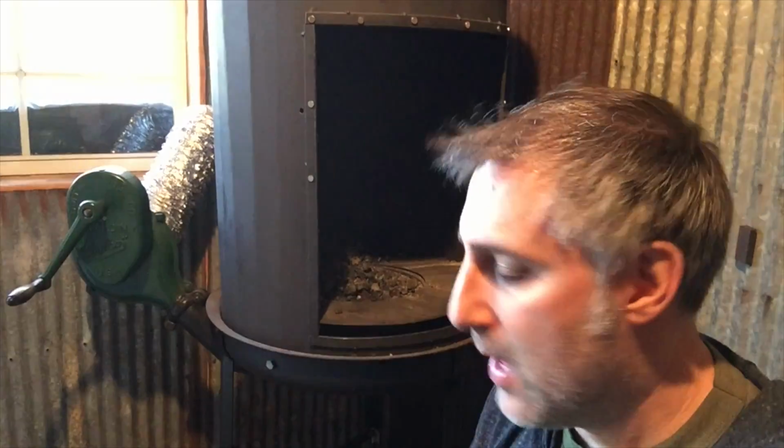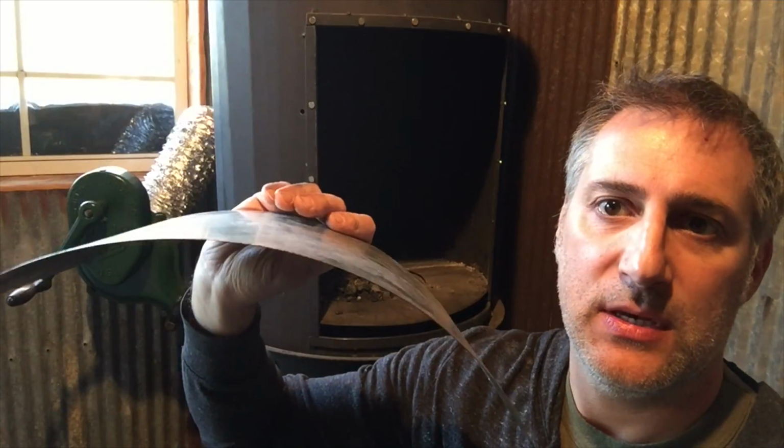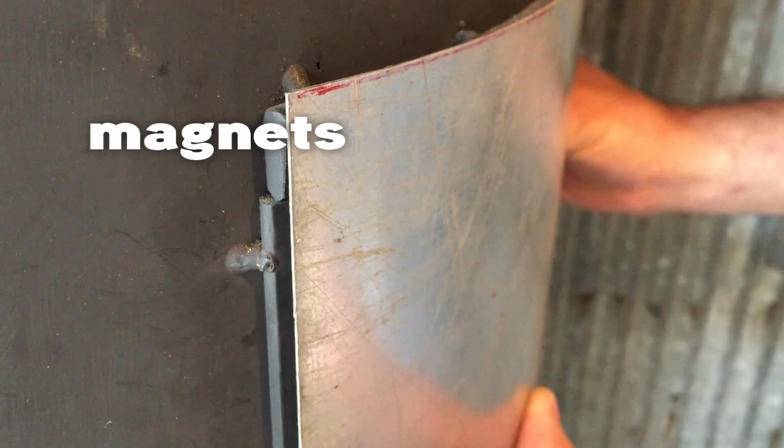Well, what I discovered is if you close the opening around your fire and prevent a lot of the ambient air from mixing with the hot air from the fire, you can get a good draft even through the wacky setup that I have. I get almost zero smoke coming back in, and I mean like zero. I bent these pieces of metal. That closes my opening. And it worked out well.